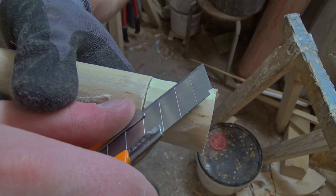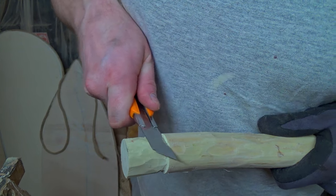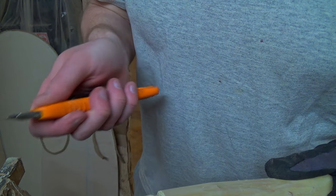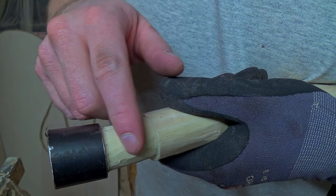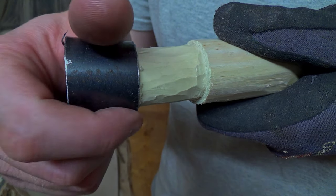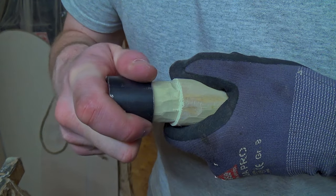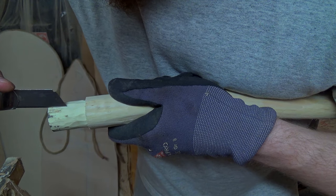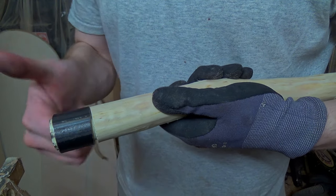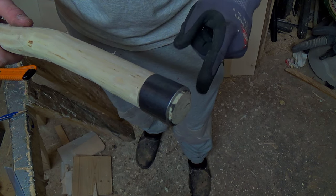As you can see the inner and outer diameter vary a lot, and to apply the steel pipe to the wooden stick we're gonna have to remove some material. Pay attention to this small ridge — if you try to apply it while rotating it will never quite fit. So keep that in mind. We still have a little ridge here so we'll carefully cut towards it. This is the safest way. Now let's mark the point where the pipe goes in and make a small V for that.